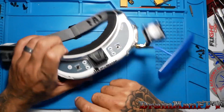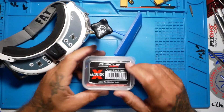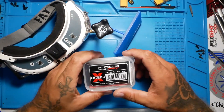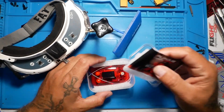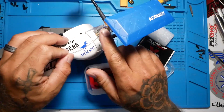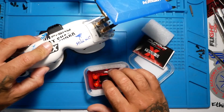Hey Pilots, Drainman here. Today we are going to learn how to modify the Fat Shark Goggles. There are two reasons why you might want to do this. Reason number one is you just got yourself a brand new TrueDX or possibly a brand new Rapid Fire. The alternative to modifying your goggles is you just open up your package, pull out this little ribbon cable, plug it in on one side of the goggle into the module, and plug it in the other side with the little adapter they give you. That's going to allow enough voltage to power your new module.